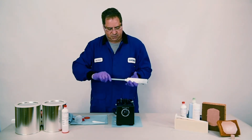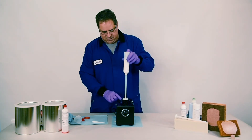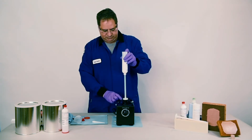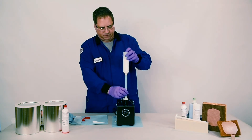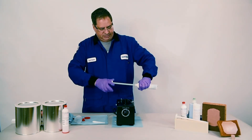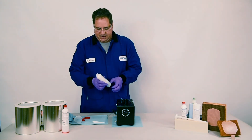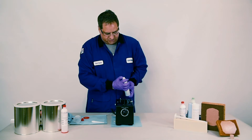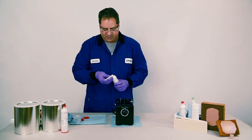Remove the dasher rod. Hold this and make sure it's secured firmly. Using that paper towel that you put in the back end, attach it to a mixing machine. One full revolution should be up and down as well. Mixer's off. Remove the plunger — grasp the cartridge tightly, turn the plunger counterclockwise, and remove it from the impeller and set it aside. Take the paper towel and push gently to apply some pressure to remove any excess air that may be trapped inside the cartridge. Once the material reaches the top, remove the paper towel and apply the applicator nozzle.